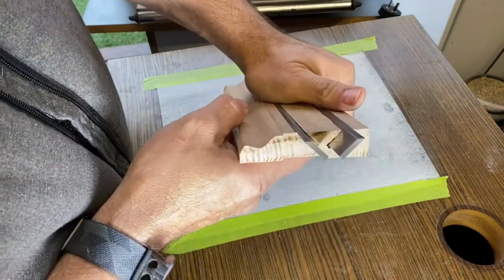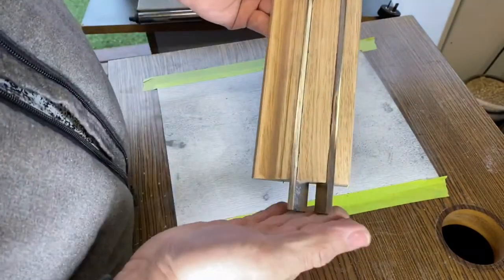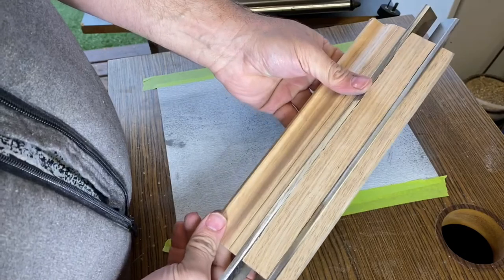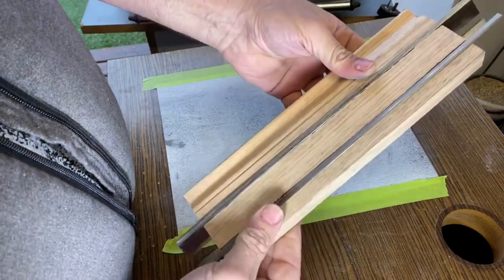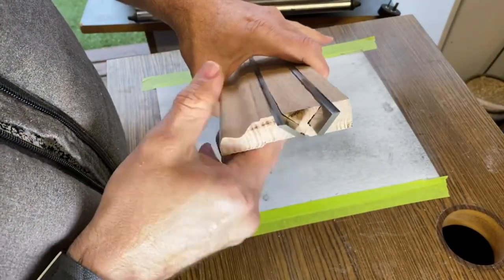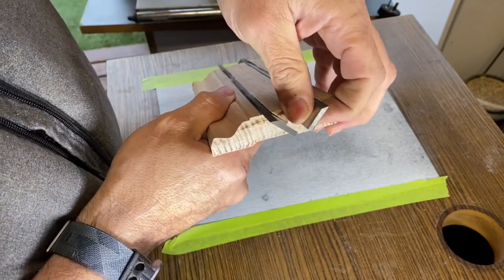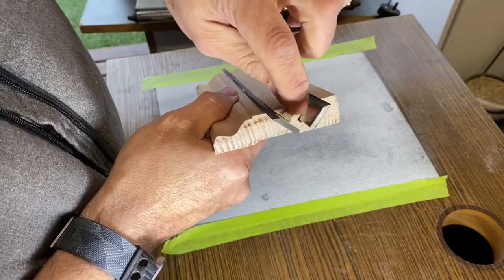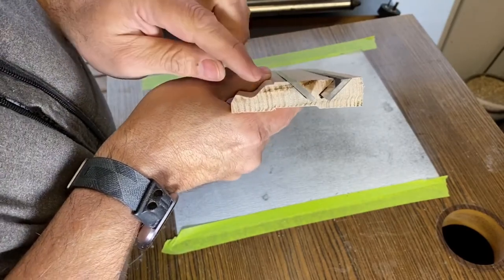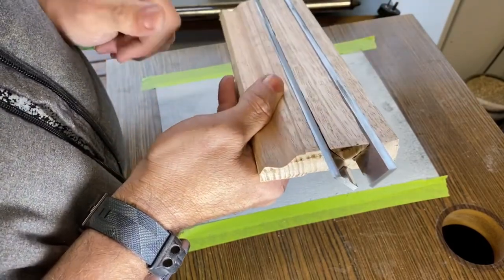Alright, so now this is a quick and easy one. Now, if I had a bigger piece of hardwood, ideally I would have made something a bit bigger, just to make sure we don't catch our fingers on it. But that's what I have lying around at the moment. At the end of the day, I'll do another video where I probably make a proper one of these. Now, the idea of this is basically these are cut at 45 degree angles. And then the depth of these cuts is kind of irrelevant, but you want a good portion of the blade to be actually in the slot. Now I've just cut it absolutely perfectly, so I don't know if you can see, but we're basically just 1 or 2 mil proud of the actual timber. But at the end of the day, they're both at a 45 degree angle.